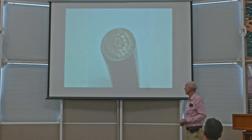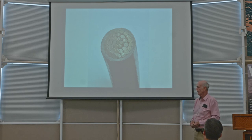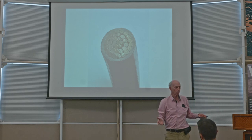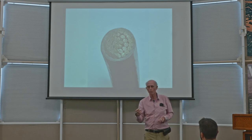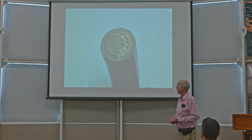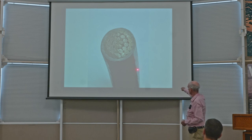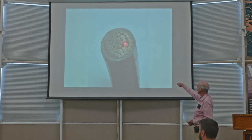And this is another thought. That's an electrical wire, a big fat one like my thumb thickness. And of course, we have a lot of electrical power supply in Biosphere 2. And I'm saying to myself, well, you're going to bring a wire in to bring electric power in. You're going to go through the wall. Are you going to put this cable through the wall and put silicon seal around the edge of the cable where it goes through the wall and call that an airtight penetration of the electrical? No, because see all these little gaps between the wires and the inside.